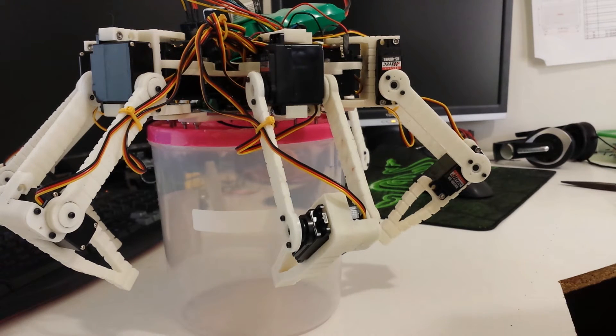I do still need to do some calibration to get the legs nicely zeroed, since the servo horns use a standard C1 24-tooth spline. Each one is going to have an error of up to about 7.5 degrees — not a huge error, but the motion will be a great deal smoother if I sort that out. I'm not sure if I'll bother since I'll only be sticking with Phoenix Code for not too long, but I might do it at a later date when I want to compare my software with Phoenix to see if mine can be improved.